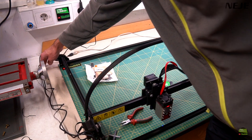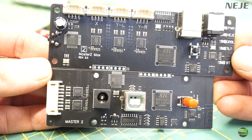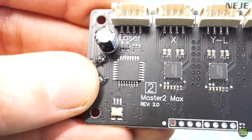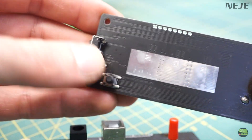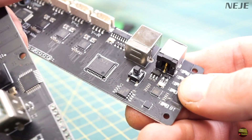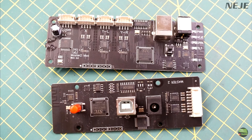We need to be a bit careful about the cables from the motherboard so they don't snag anywhere — a 3D-printed cable chain would be a nice modification here. The motherboard is a bit different from the Neji 2: it has two 8-bit microcontrollers, one for Neji software and one for GRBL. It has separate drivers for the Y motors. Both X and Y limit switches are directly on the motherboard. It has a capacitor, and the power plug is really quality so it won't lose power while pulling the cable around.